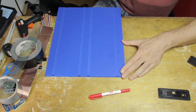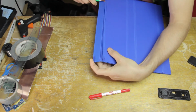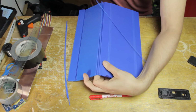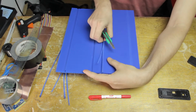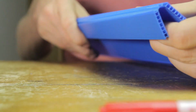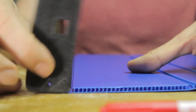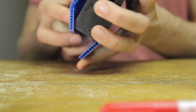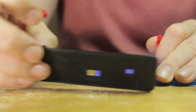So now once I'm finished with all the cuts, I'm going to remove that surplus material, just repeating the technique from the previous build, and that's going to put those bends on the inside, just like before. The difference here, of course, is that we're going to bend this piece around the box ends. So that's going to give it a much more polished final result that you'll be able to appreciate in a little while. What you see me doing here is struggling a little bit with the material. For some reason, this blue polypropylene, which has the same measurements as the black stuff that I used in the previous instrument, is a little bit tougher and harder to bend. So I'm not sure what that's about.